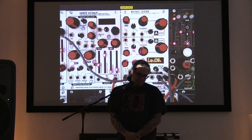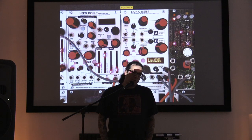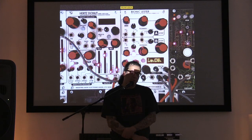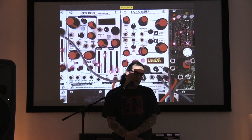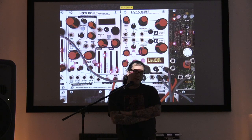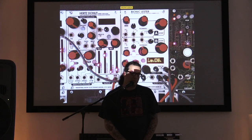I've also brought a prototype of a new device with me that I've been threatening to release for a few years. It is called Volkmeyer's Inferno, and it is a granular synthesizer meant to perform equally well under live input or file playback situations. It takes your input audio and considers the input buffer as a field from which several dozen grains of audio are picked and enveloped and overlaid and played at various speeds to create a thick cloud of sound.